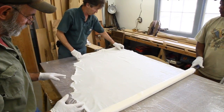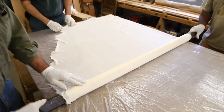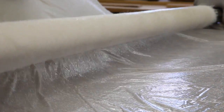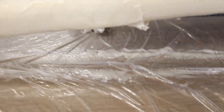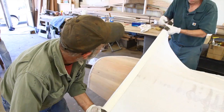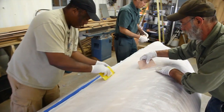The cloth is very hard to handle because when you try to pick it up it stretches and ruins the whole nap of it. That's why we can't lift this cloth onto the boat without the aid of this stick. So we're going to roll it up on this stick here. You'll see how much extra resin we've got in it. I'm just taking my fingers and squeezing out some of the extra resin so we don't have too much in there — you can see it just laying on the table alongside. We've got it basically wrinkle free now.